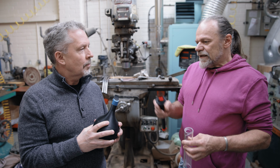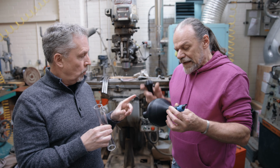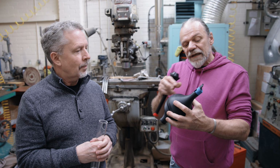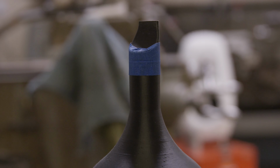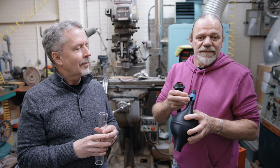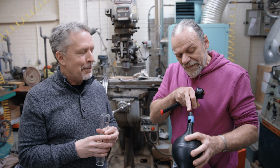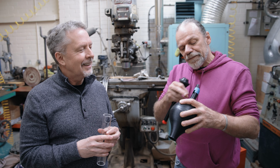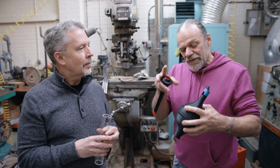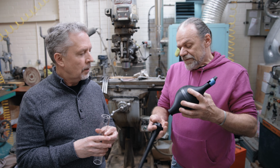Okay. And so I have a little demonstration here. This represents the cabinet, I understand. That's right. Can you explain that? I need that. So this represents the air volume in the cabinet. And this, which is interestingly enough known as a fipple, which is common to a classic recorder, the school... I played the recorder. Yeah, okay. Well, it's exactly. You have the air jet, which plays on the sharp edge, which causes a resonance. But the frequency of the resonance is determined by the volume of air in the chamber and the size of that hole.